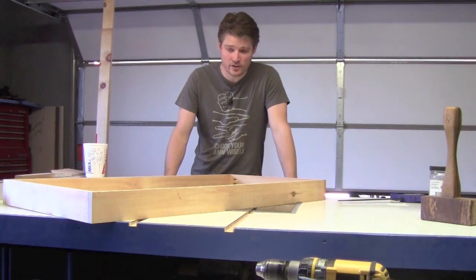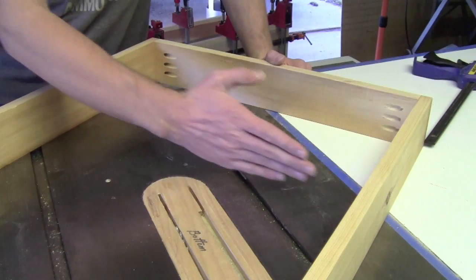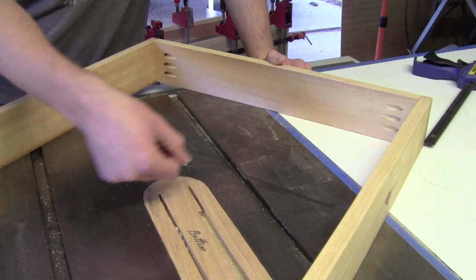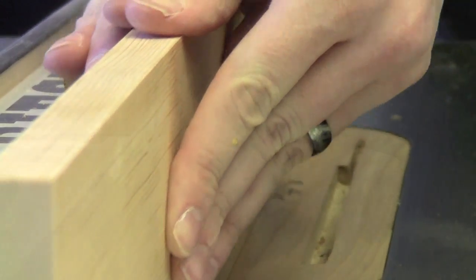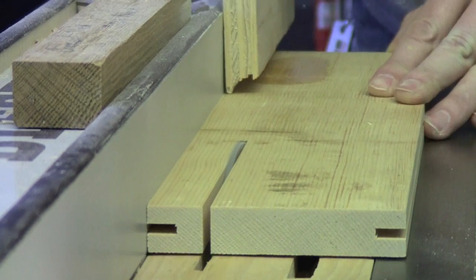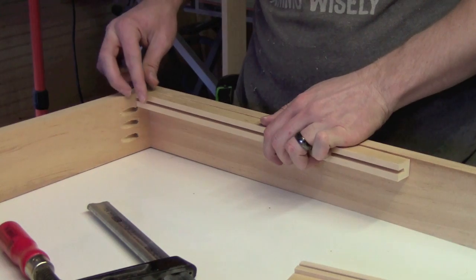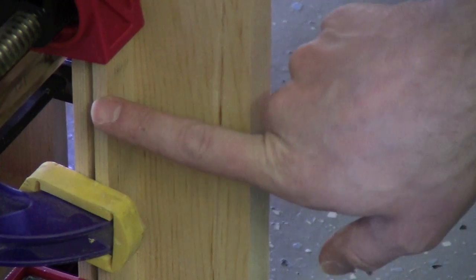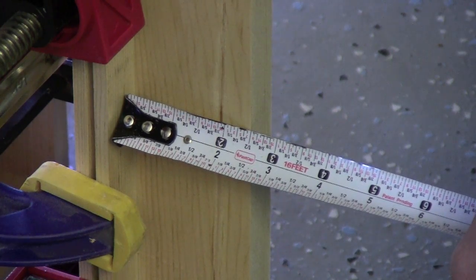Now while the tops are curing we're going to work on the aprons again. There's something I want to put in these that is something you wouldn't expect. I'm going to put a partition here that's only about the width of a bean bag or corn bag, and it's going to have a sliding door that will go across it. First we're just going to take some scrap and make a couple of pieces for the channels. Now we're just going to glue these flush with the top. With the guide rails installed I can see how wide my partition needs to be — looks like it's going to be two and a half inches.